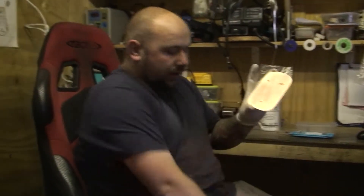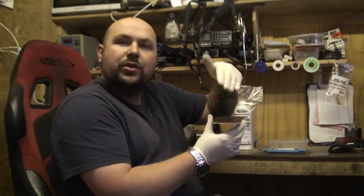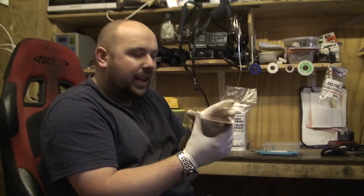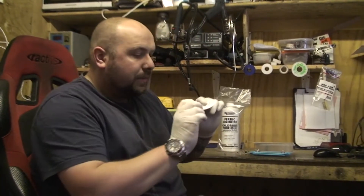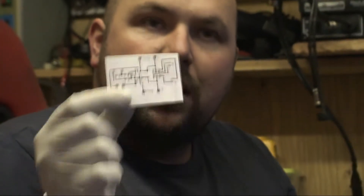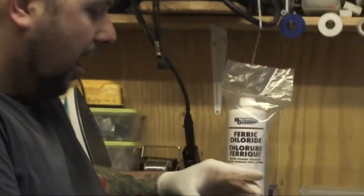I got some 800 wet and dry and I've just spent a couple of minutes sanding it all down. I'm using gloves just to stop hand prints going back on it - so that's ready to go. To cut a board you can use a hacksaw, or I just use a Stanley knife and kept scoring and scoring it. Now the most important thing - this is my circuit board and it has to be printed reversed, because when you flip it over to transfer it, it needs to be mirror image. Also very important: this is printed on a laser printer.